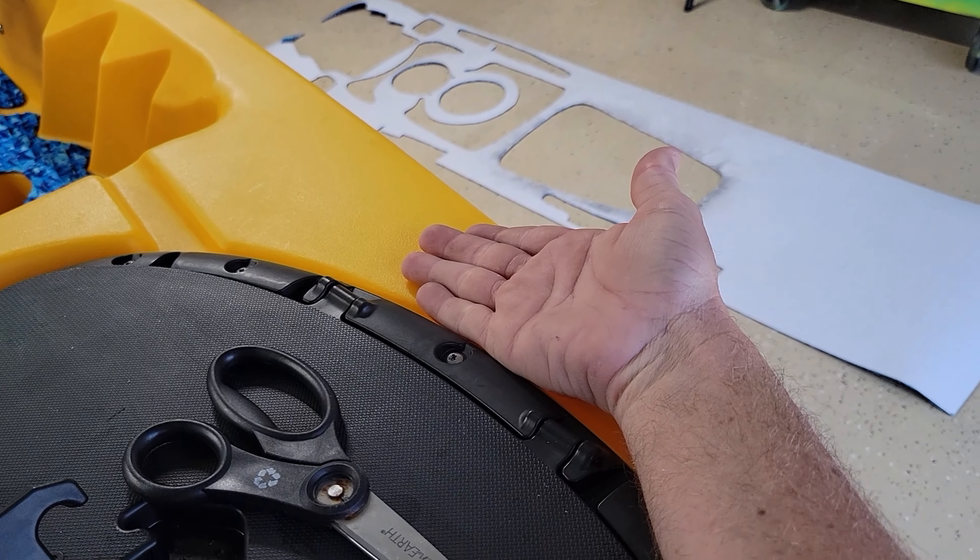If you notice when I cut a piece like this one here because of this curve, I'm cutting it upside down. So when I make my pattern, I've got to turn my pattern upside down to create the proper side — or if they're duplicate pieces, I could keep it the same and make another one later. If it's a straight pattern, that's pretty easy — one cut and it'll fit. But for a curved piece, I have to take the pattern out and flip it upside down when I put it down onto the sea decking, because the sea decking is upside down. So be prepared for that when you do those kinds of cuts.